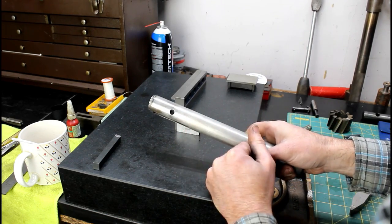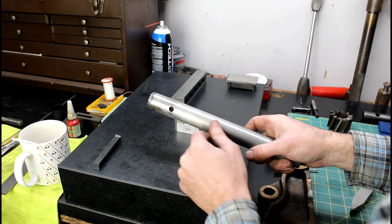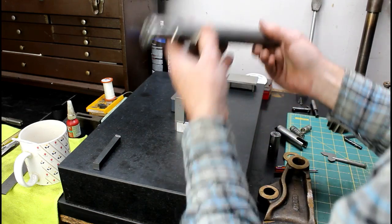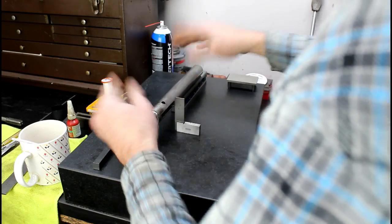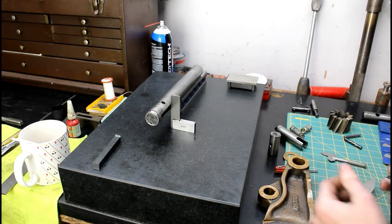And then we're going to have to address this off-center hole. So you have to come in and use a coaxial indicator on this one, set it up in the mill, and then transfer our new shaft over and drill our hole. That's probably the way I'm going to do it. I'm still not for sure. You've got to think all this stuff out, and that's what I'm doing.